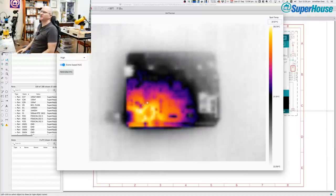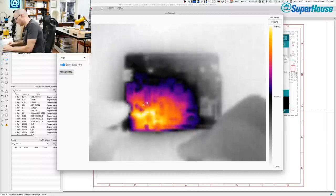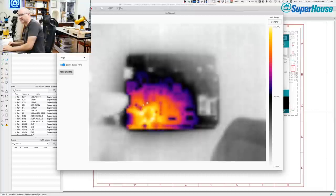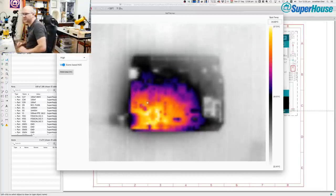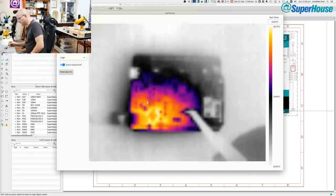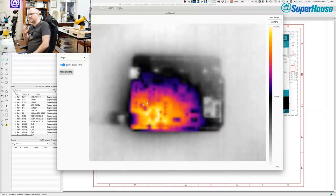Oh, I know what. Okay, I was looking at the wrong diode. I thought this was the diode that I had just added, and it wasn't. So this has led me on a bit of a wild goose chase. What's happened is there is something on the board that is short circuiting. It may end up being this regulator now. So the next thing is I'll float that off. But what's happening is that, oh, actually no. The actual short circuit is probably downstream of the 5-volt regulator.